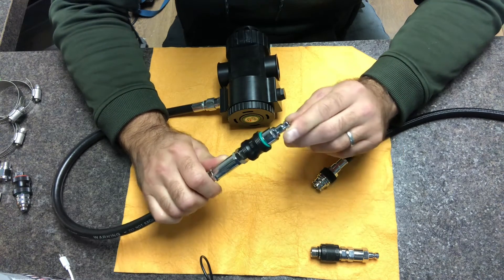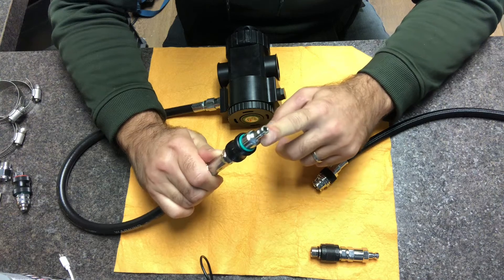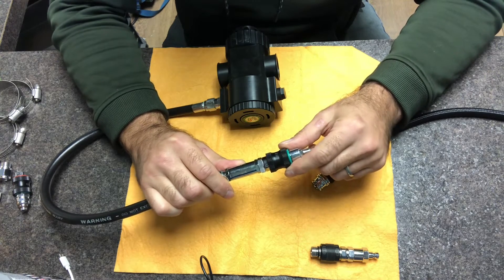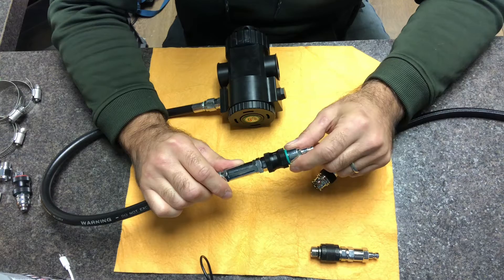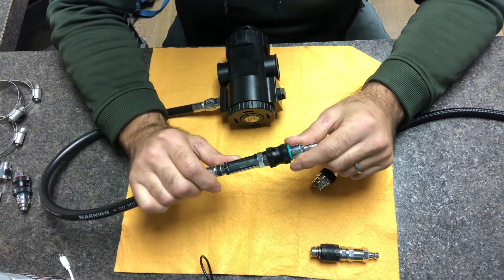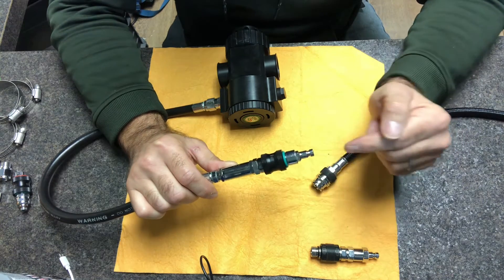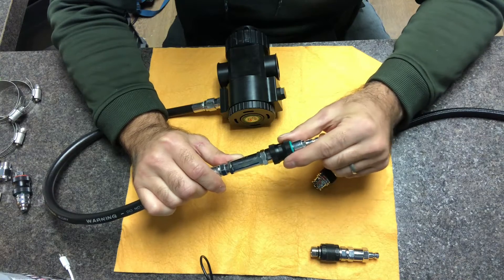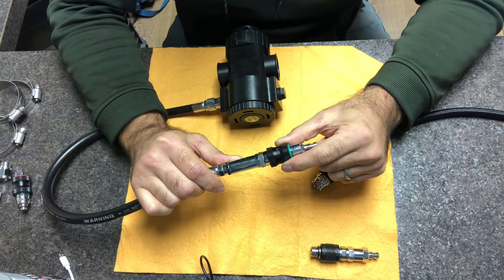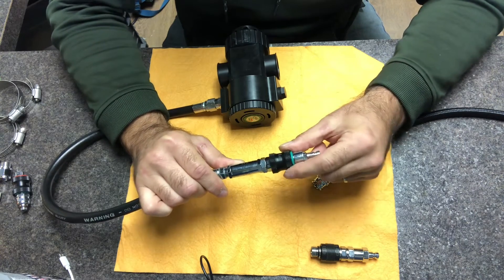There are several important features here. We have a CEJN or Sequest style high-flow nipple with a wide bore for high flow. Then through an on-off slider, which allows us to essentially feather the ADV in the case that we're free-flowing — we can shut that valve on and off right here at our fingertips. The direction of that valve flows towards the device being supplied, so we slide with flow towards the ADV to turn it on, and slide back towards the supply to shut off. When it's off we see a red ring; when it's on we see a green ring.